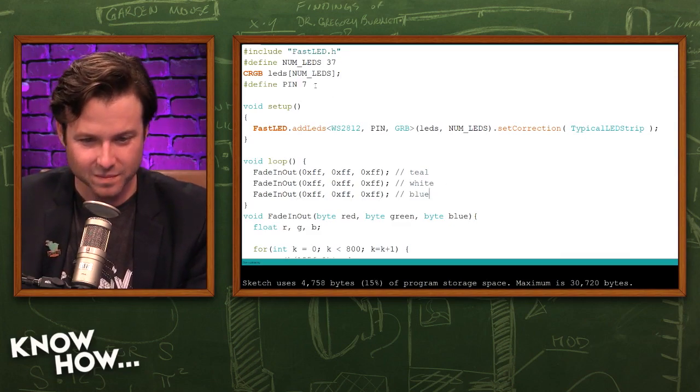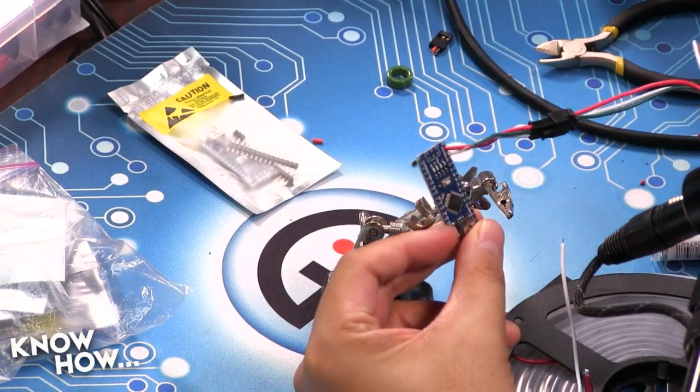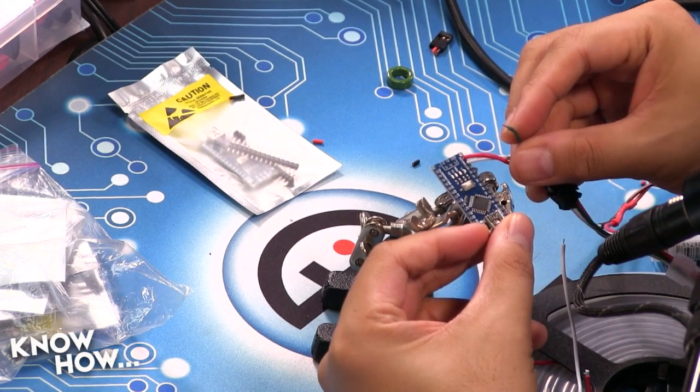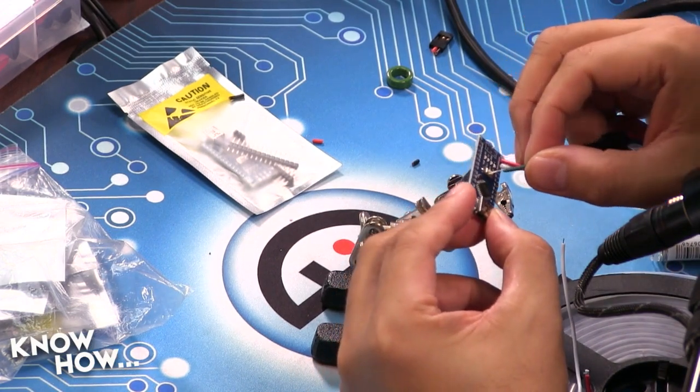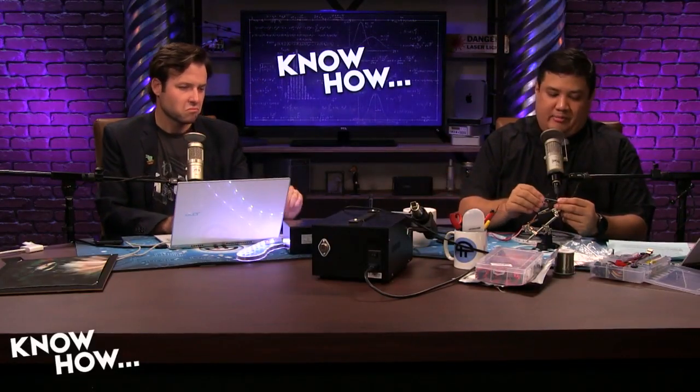All right, so if you look here, I've got voltage coming in, and I've got my ground. I'm assuming white is ground, even though that's a really weird choice. And then my green wire here is supposed to be the digital pin. You said pin 7, correct? Correct. If I connected it to a different pin, you would just change the addressing inside the program, and we'd be good to go.